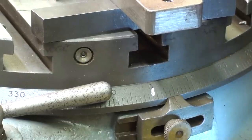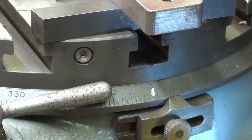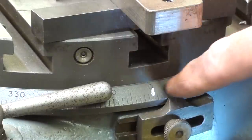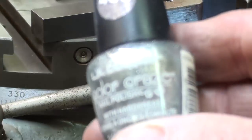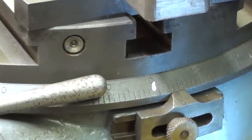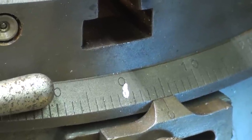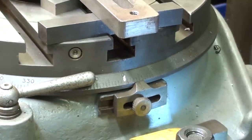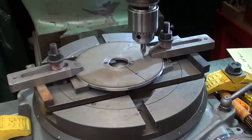It is so easy to make a mistake when indexing a rotary table, so I'm going to temporarily mark the protractor that goes all the way around. I didn't have any white marker, so I had to use my granddaughter's silver nail polish — acetone should take that off. Starting at zero, then at 24, 48, and so on all the way around. I'll be doing that off camera. That was quite a lengthy setup, but I'm finally ready to make some chips.